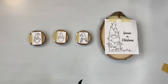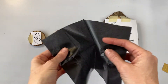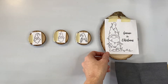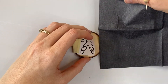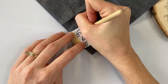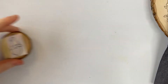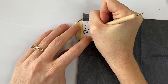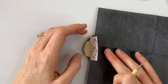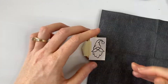The next step is to use your carbon paper. Unfold it — you want to have the gray side up and the shiny dark side down on the wood, in between the wood and the pattern. Now when you are tracing, you might consider tracing lightly, because if you need to erase something or you don't like it, it'll be very hard to get rid of if it's on there hard.